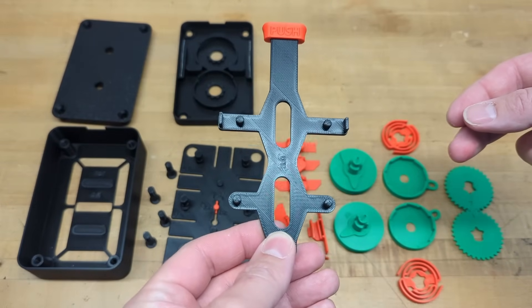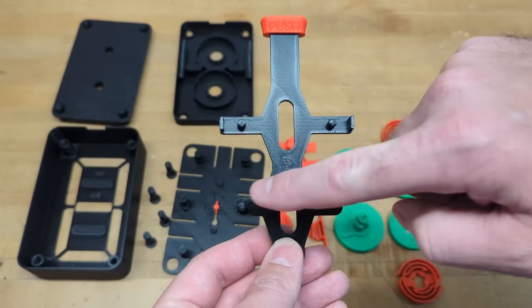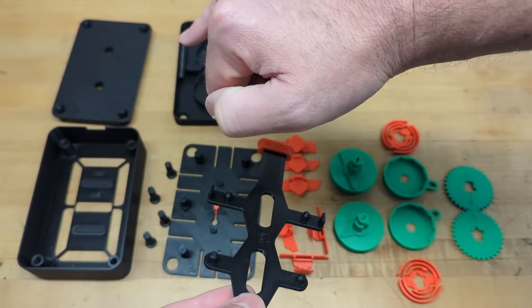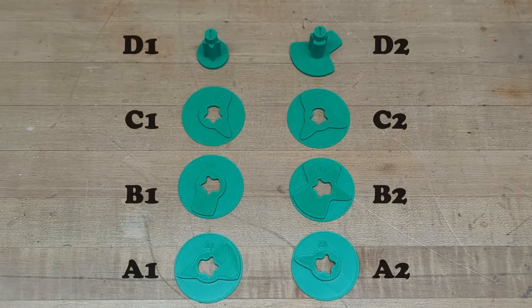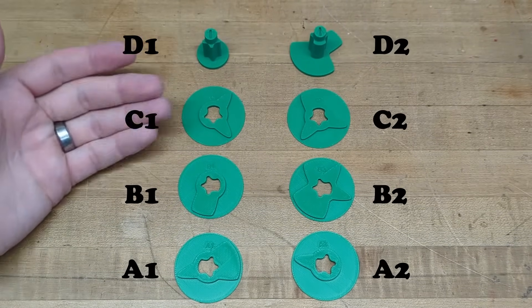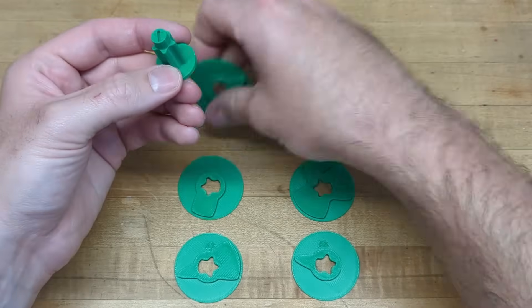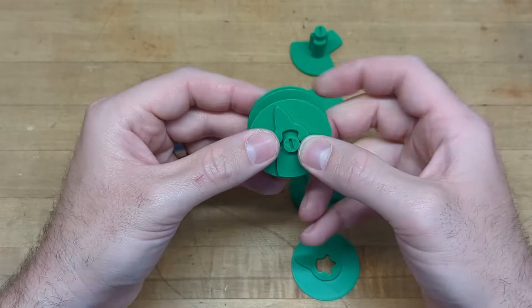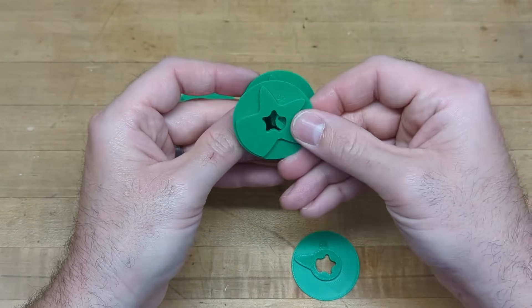The push action height has been increased for rigidity and it now has a symmetrical design with pegs, compatible with either forward or reverse orientation of the spring drums. There is a peg to account for each scenario. These two extrusions now make contact with the new coil springs on the mid plate. For the cam layout, similar to version two, they stack on the respective D cam. The order starts with D, followed by C, B, then A. So assembling stack one: D1 cam, then C, then B, then A. Then D2: C2, B2, and A2.